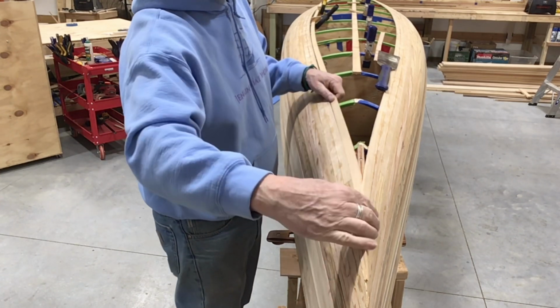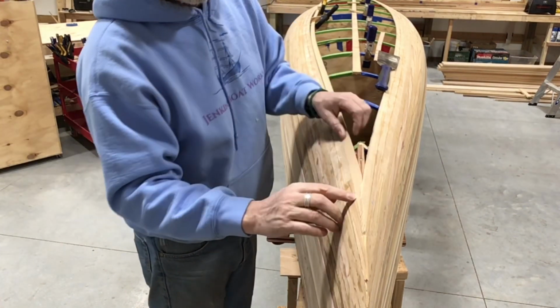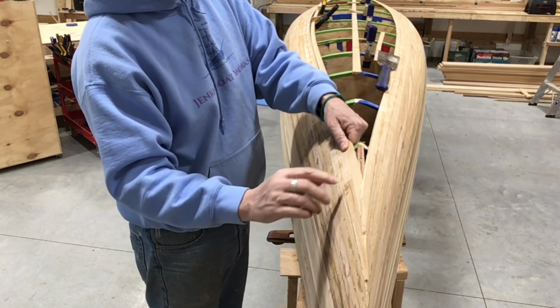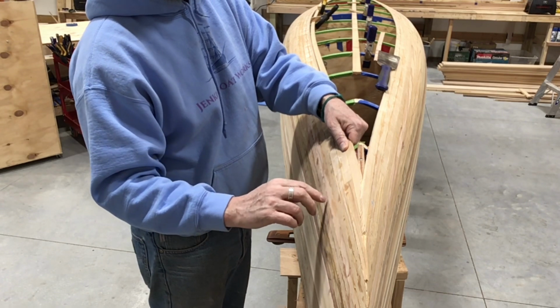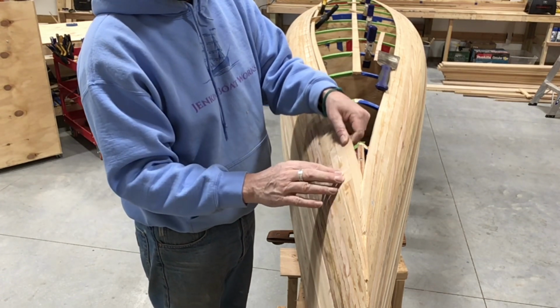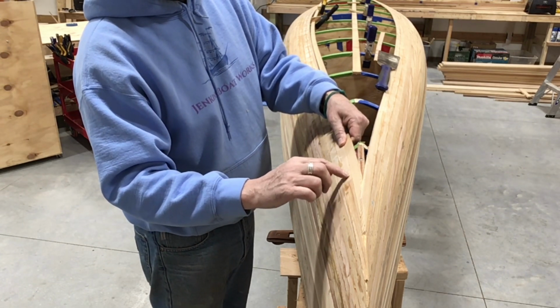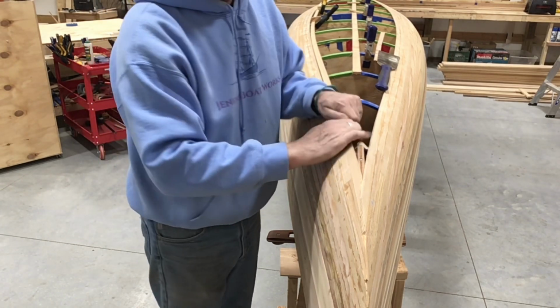So, when I go and put that in there, see that's fitting in there way better because we trimmed off that inside edge. That's going to lay in there just good. Now I still got just a little gap right there that I'm not super happy about, but I think it's because the canoe's kind of bending down just a little bit. And it could be because of this scarf joint. I think I might be just a little bit thick on this existing strip. Let's pull this out of there